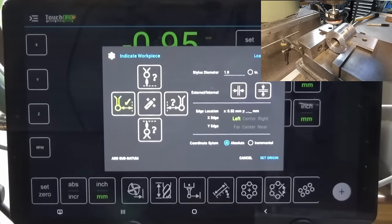Now, I'm using Teflon because I had it and it's sort of soft and squishy and resilient, and I've been able to machine a dimple in the end of that to engage on the spherical surface of the ball. Now, you don't have to use Teflon. You could use a strong spring of suitable dimensions. You could use some thick-walled PVC tubing. Basically, anything that's soft enough that you can put pressure on the ball bearing without locking it solid in that annular groove. Anyway, let's do this on the machine and we'll try this handle out.